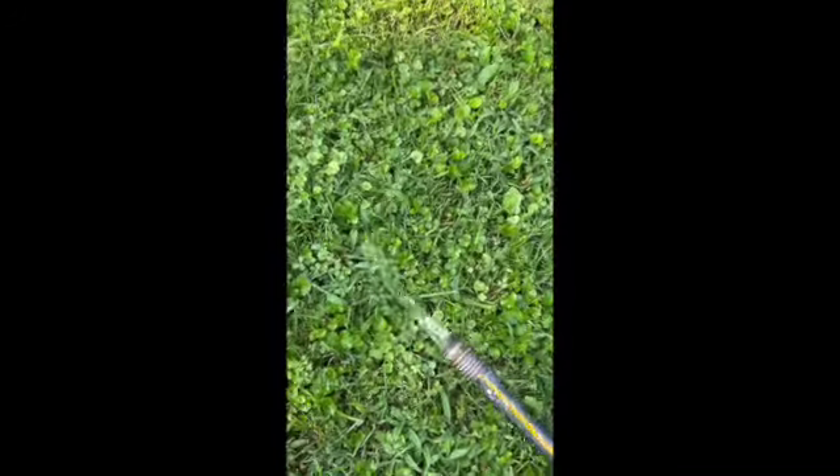There's a little bit of drippage by this connection right here, but that's fine. It drained down below that vent line too, so it stopped pouring out the vent. I just have to make sure when I fill these tanks for trips that I stay a good inch below that vent — that way it'll give it some room to slosh around. There's some gurgling going on — perfect, I love it. Now I'm just going to do some pipe management, secure this stuff so it's not shaking around, and we can continue on with the build. This part of the plumbing is hopefully sorted. Thanks for watching, Wanderers.